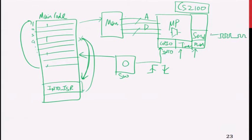Okay, data is coming in here through a pin. Correct? So again, I might not know when the data is going to come. I can be busy flashing some LED and suddenly the data comes in. Okay, so I can be busy doing something and suddenly data is coming in on my serial port. So what must I do? Again, I must make sure that I configure an interrupt for this.